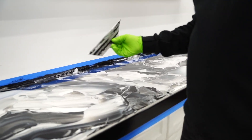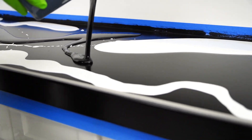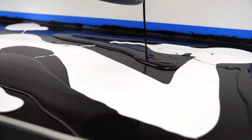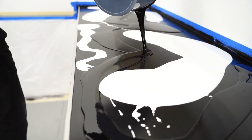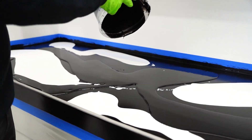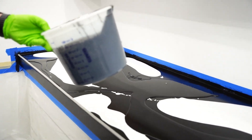I'm going to be pouring out buckets randomly and then blending with a Leggari squeegee cut down. I'm going to pour the black in between all the white spots. Just going random here, making sure I'm getting color all throughout this countertop. There are lots of ways to pour this stuff out, but you're about to see how easy it is to create amazing looking countertops by simply pouring out of a bucket and moving a little product around with the squeegee. All right, there it is — now we can walk away, let it do its thing, and these are going to look amazing.